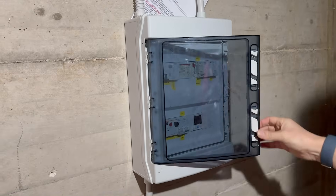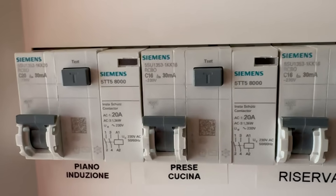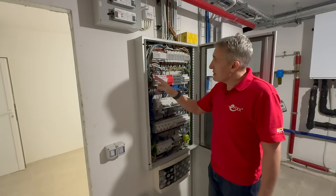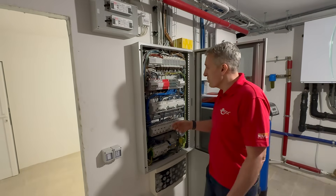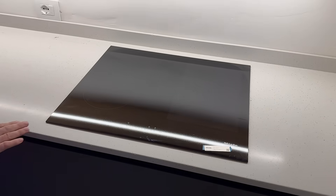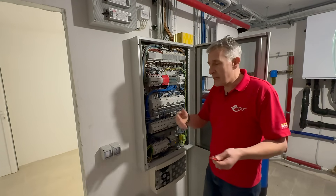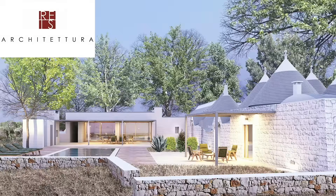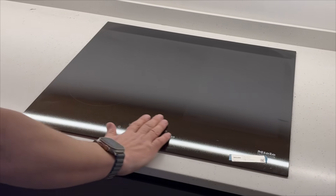There's one tucked away under the swimming pool. We've got a lot of actuators here, presumably for the pumps, individually wired. And here's the answer to all those contactors we saw in the other distribution boards. If we look at the incoming supply, there are three toroids or current transformers fitted around the conductors connected to this load control device, which communicates with the other contactors in the other boards on those high-power appliances. The reason for that is with seven kilowatts per phase, once you factor in induction hobs and the heat pump, you could exceed the rating of the incoming supply and trip everything out. So the load control is looking at what the property is using and making decisions to switch off some high current appliances to avoid tripping that incoming breaker.